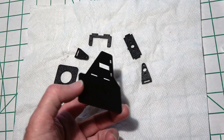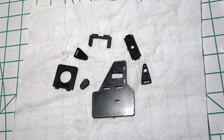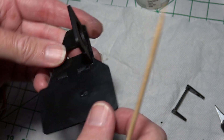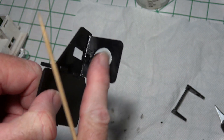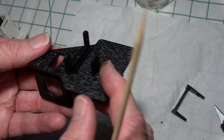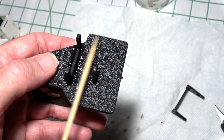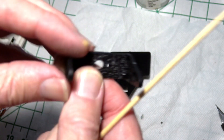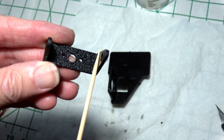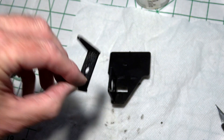When you put this plate together, make sure the shiny side here is up, because that's where you're going to put your Velcro for your camera. You can see here that the shiny side is right here on the top for the plate. For the camera mount, the shiny side is on the back and rough is in the front with the CXN logo. These things on the bottom to mount the servo — the shiny side is on the outside, on both of them. Rough on the inside. Then for the tilt right here, the rough sides are on the outside and shiny in the middle — that's the smooth part. For this cross member, it's rough on top and smooth on the bottom. That's how you put it together.